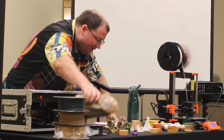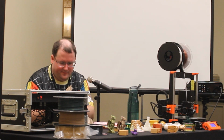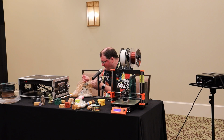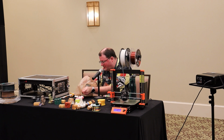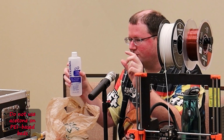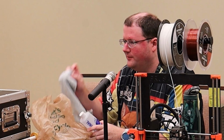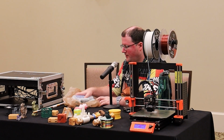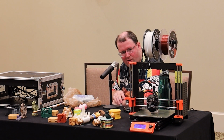You will need to keep things clean and maintained. There's a couple different solutions you can use, a couple different products you can order online, like 3D printer cleaner or whatnot. Honestly, you just get some cheap acetone. Put just a little drop on a little washcloth, wipe off your print bed, and you're done. You don't need to worry about specialty products. Obviously, if you use it a lot, you will want to replace parts. That's not too hard either.